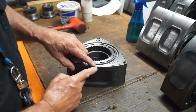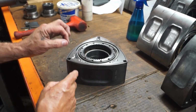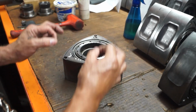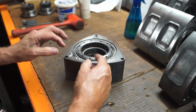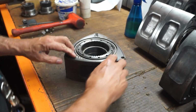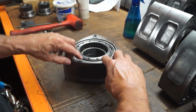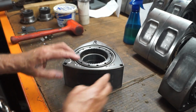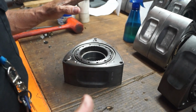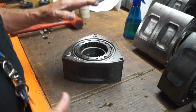Now I was heavy, otherwise I wouldn't have that mark. And I was taking out the amount. I shifted the weight over. It's taking out the amount with the grinder by just going meep, meep, meep with these little balls. And basically, you know, you start from the center and work your way out in order to shift the weight back to where it's negligible at that point. Okay?